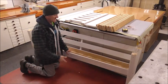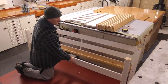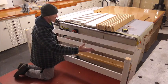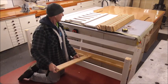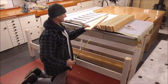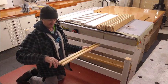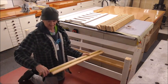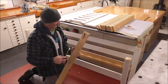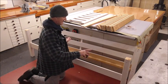Here you can see are the pieces of the bed that we've brought back to the workshop, ready to change the shape of. The length is fine, so there's no problem with that. But on the width side of it, we've got quite a bit too much. These slats here want to be 750, because that is the space between the two side walls that we need for the mattress, and this is 900, so we can get 150 back there, so a good bit of space saving. Lengthwise, we don't need to adjust that at all, that is fine.